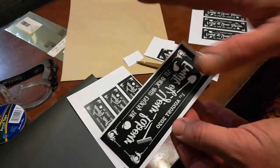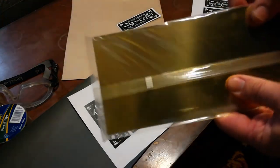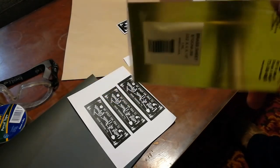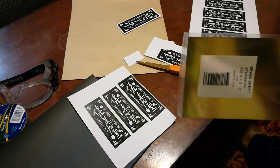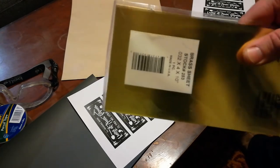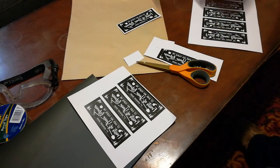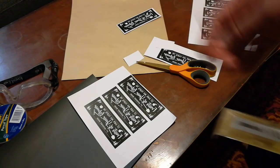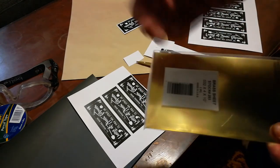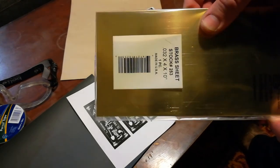It'll actually stick to the brass. I didn't think there was any brass in the local hardware store, but turns out there is. So all that nonsense of me flattening that pipe — I think it's better off if I just go with this sheet instead. I noticed that on the pipe I had flattened, where it had grooves for the pipe thread, it was actually really close to the other side which I'd made flush, so there wasn't actually that much depth to play with for etching the engraving. So yeah, I just got this sheet — hopefully that'll do the trick.